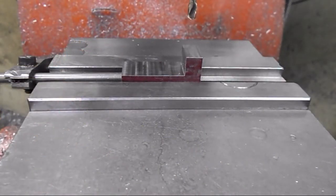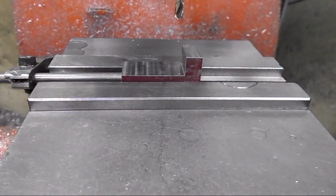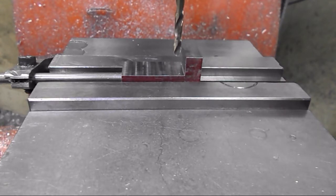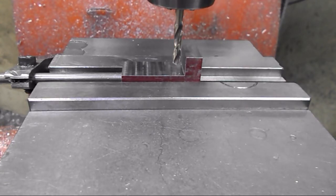It's time to drill some holes for the end mill to do the slots. The first hole I'm going to drill at zero, which is just about right up at the shoulder right here. I'm going to use a 3/16 stub drill, and then I'm going to come up here to 1 and 1/16 inch and drill that side out.